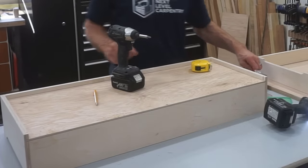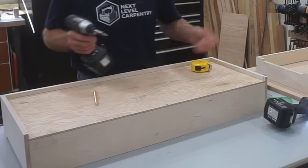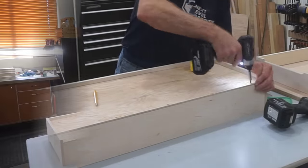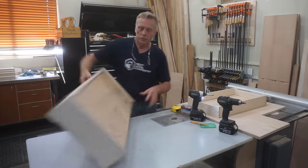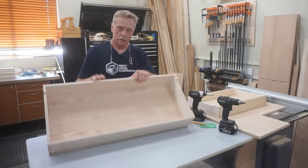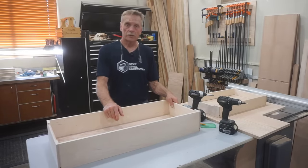And yes, that takes longer than going bam, bam, bam, bam, bam with a staple gun. But if you have one staple that splits out, where does that put you? And that's the procedure I use on all the wide drawers and all the narrow ones, for a nice sturdy drawer. And then that rattling will go away when the parts are lacquered and I glue it up for the final assembly.